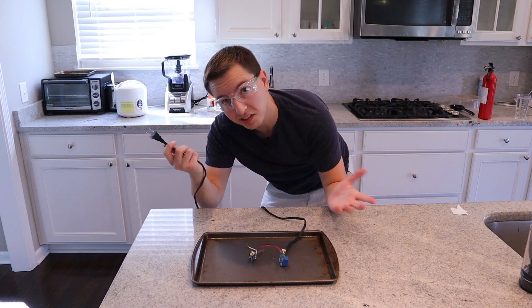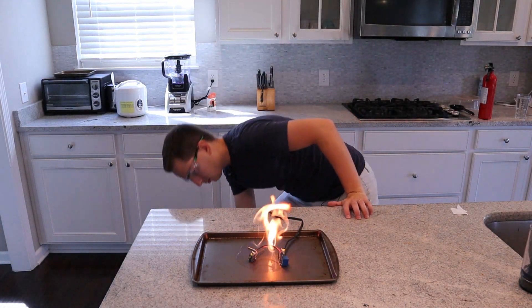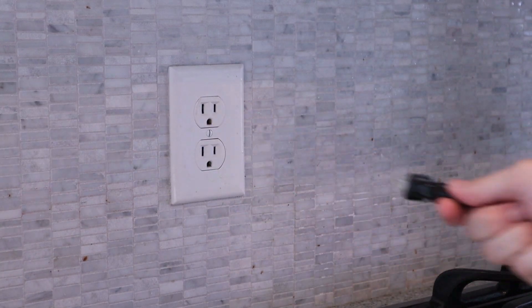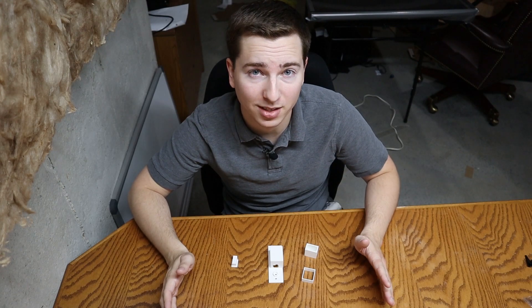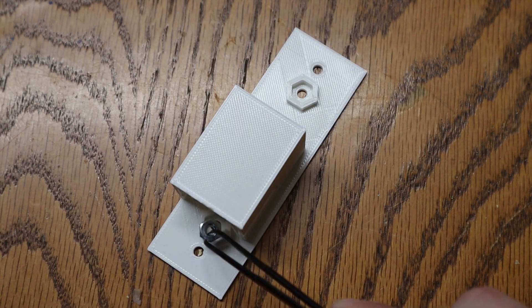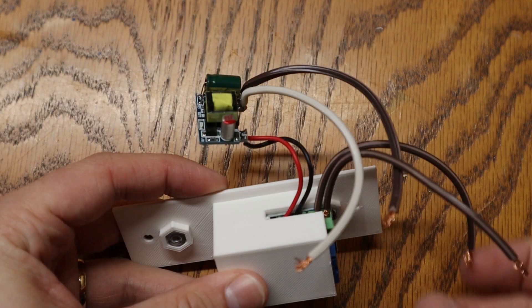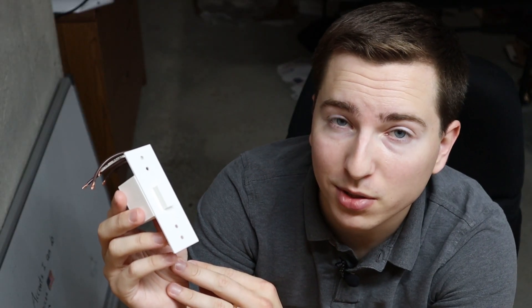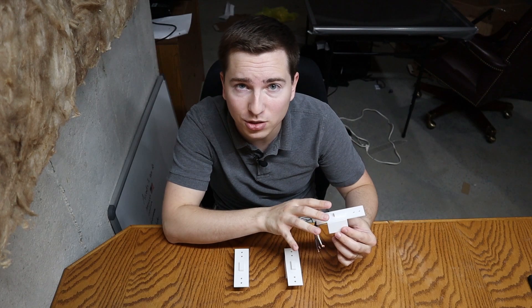The hardware is done, now we need to plug it in. I'm horrible at mechanical design, but this is what I came up with for the case. The mounting plate isn't so bad. To give a thread for the light switch cover screws to attach to, insert number six nuts into the plastic plate. Insert the button into the hole. Insert the relay module with the button on bottom. Now we've got something pretty close to the original switch, but instead of a switch, it's a single button. One very important thing: I want this to act as a normal light switch even if the Wi-Fi goes out.